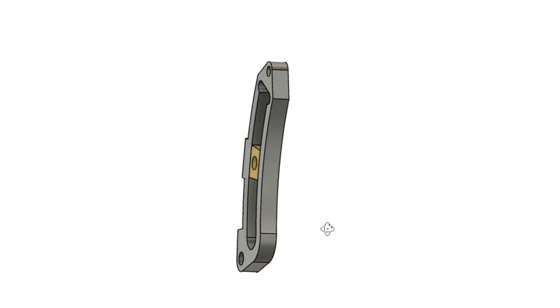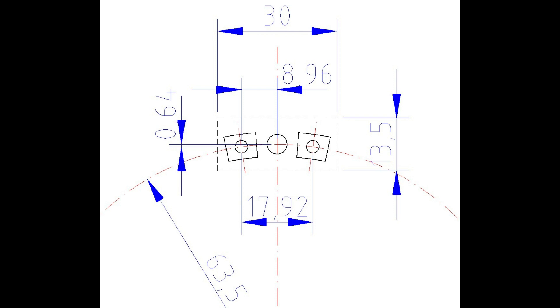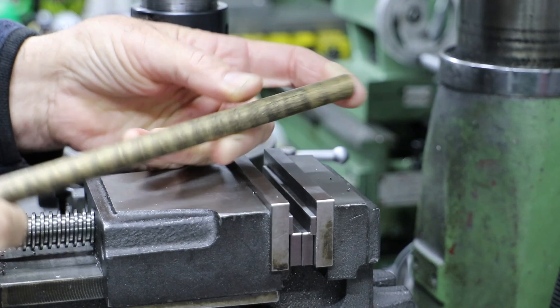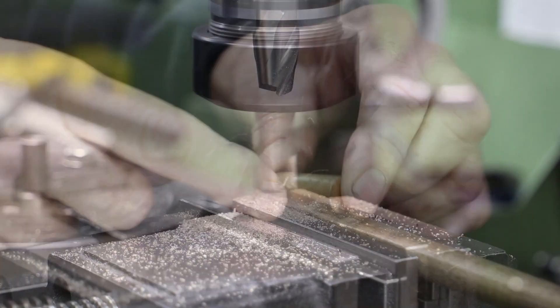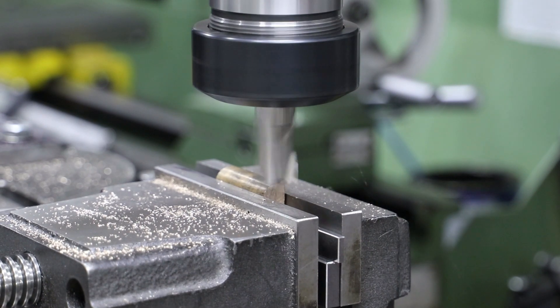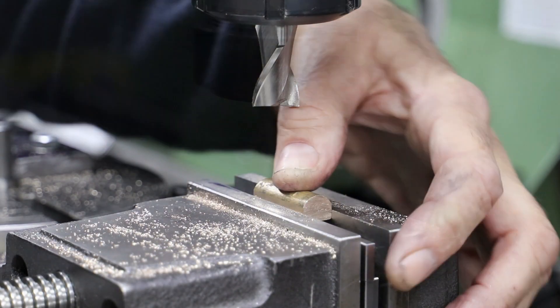I'll be reusing my jig and making them as a pair. For stock I've got some round bar which is around 30 and a half millimeter diameter. To make a pair I need to reduce this down to a piece four mil deep, 12 mil across, and approximately 30 mil long. I clamp the bar into the vice, knock off one side flat, and then work around the other dimensions.